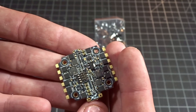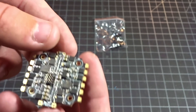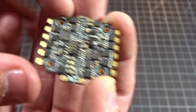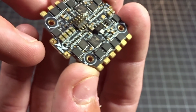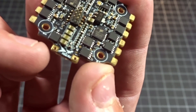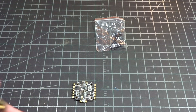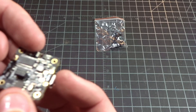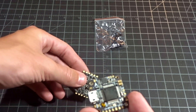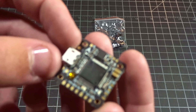Taking a look at the ESC, I don't see any voltage regulators anywhere, and I don't see any mention of anything on the pads, so I don't think this has any 5 or 12 volt outputs. I'm not sure what these tiny pads up here are, although they're probably just V-bat out. On the bottom here you have your battery pads. I wish they would have made these larger — the ESC pads are the exact same size, if not even larger, than the battery pads. On the flight controller up top you can see we just have our 5 volt output, and this takes full battery voltage plugged straight into the four-in-one ESC, then supplies 5 volts out to the VTX and 5 volts out to the camera.